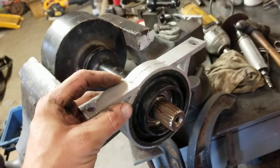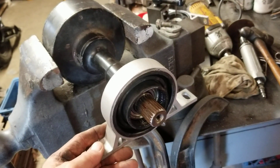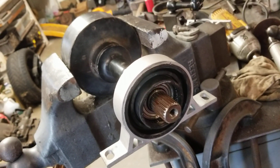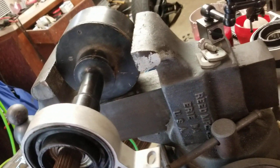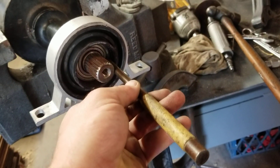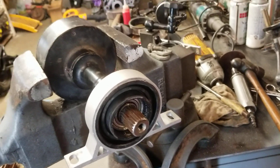But for how cheap these were, I figured it's worth a try. They go right on — it turns out the bearing size is identical. They go on with just a really light press fit. I just used a punch or drift, put it on the inner race and just walked it around, being careful to avoid hitting the bearing shield, and it went right on smooth.